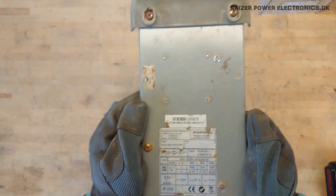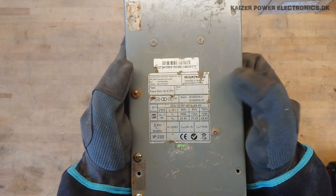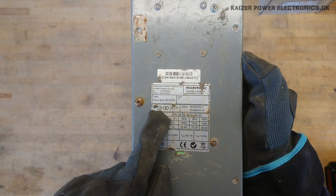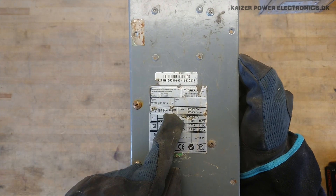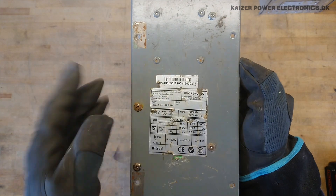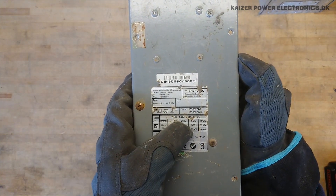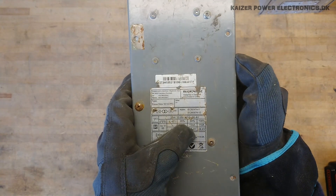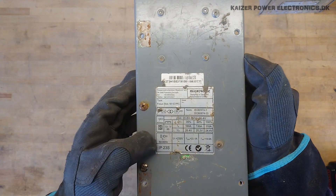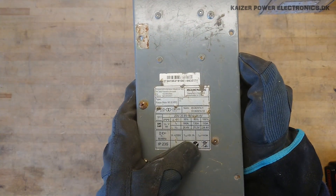There's a sticker at the bottom: Factory Megatronic, designed in Denmark, assembled in China. We actually have a small functional diagram — F1 to F2, so frequency converter, isolation transformer, rectification diode, and then a DC output. It's rated 20A at 20.8V up to 160A at 26V, for stick welding only, 230V AC at 22A — so it's meant for a single phase high current supply.